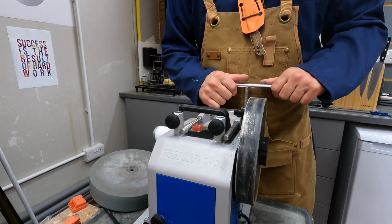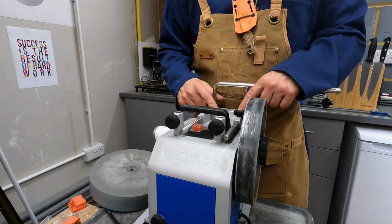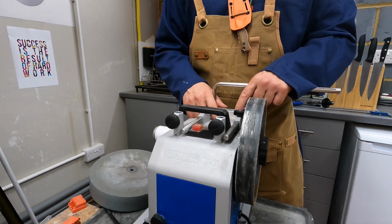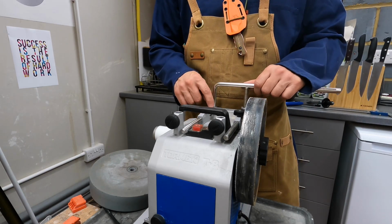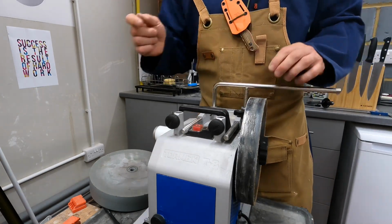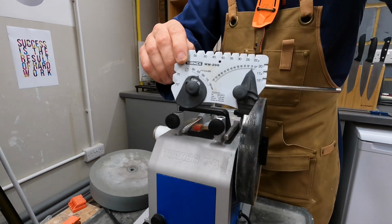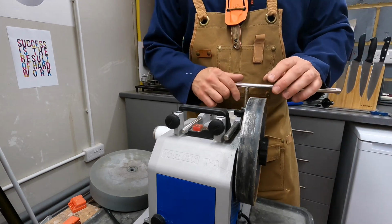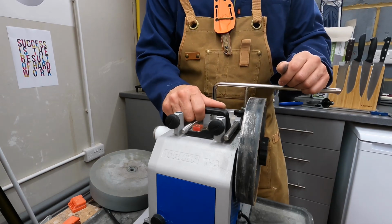So, adding a bit of detail there, but hopefully making the case, partly at least, for why the first accessory that I would buy if I was starting out with a standard issue T8, as funds allowed, is a forward vertical base to allow precise angle honing with or without software, because as I've just shown, it works pretty well just using the Tormek angle finder. Good. I think actually that's all there is to say.